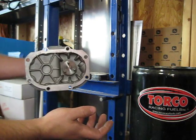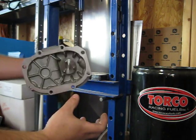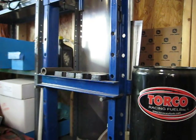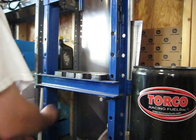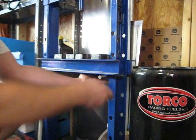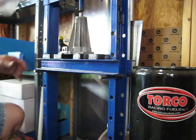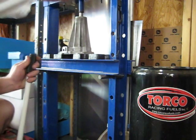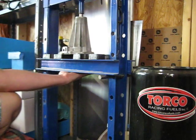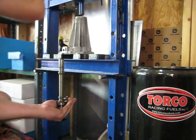You can remove the shaft in a couple different ways. You can just take a hammer, tap it on it and drive it out the bottom — it's not very hard to get it out. I prefer to use an arbor press to take it out that way, so I'll show you guys how to do that. You've got to get the table to the right height and set your plates so it will come out the bottom no problem. Keep your hand under the bottom so you can catch it. Alright, the shaft is out.